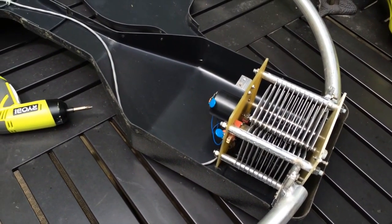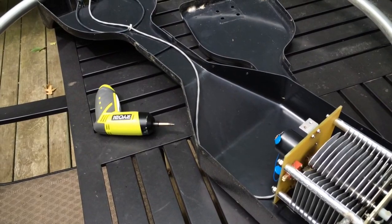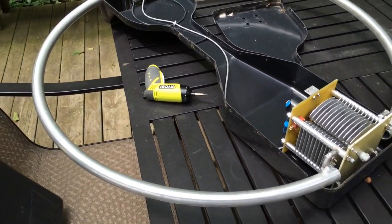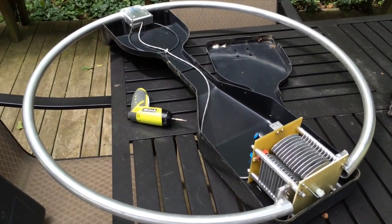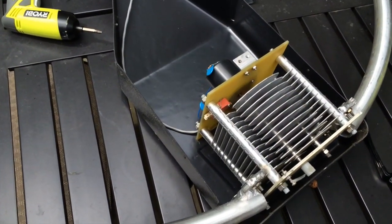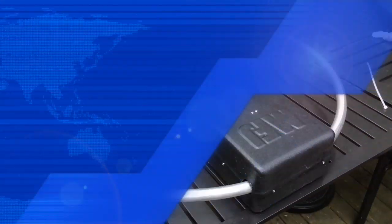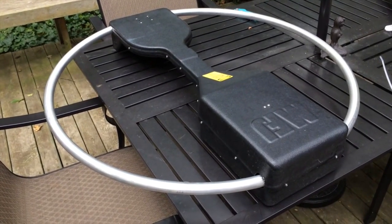I'll take a brush to it and clean it up, and see if things improve. It would be a shame if this stopped tuning — these antennas are not cheap. Surely I can fix this thing up. I think I found the culprit here — looking way down inside, right down there is a fried insect across a couple of solder joints. Pretty sure that's gonna be the problem, so we'll get that out of there.